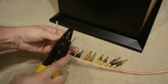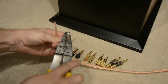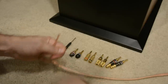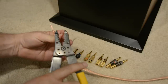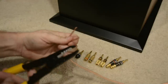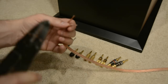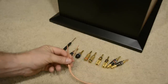If you pull on 8 gauge and nothing happens, just keep working your way down. I think it's 12 gauge what I've got. So let's go down to 12 gauge - I typically trim about a half inch. You're just going to squeeze and pull. You'll notice when you do that there's still a little jacket right here, so grab a smaller gauge and pull that off. Then do the same thing to the other side. Now we have our wire stripped.